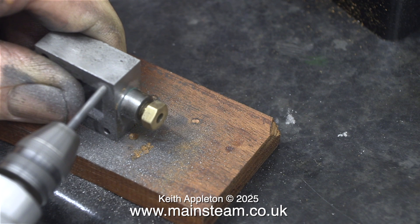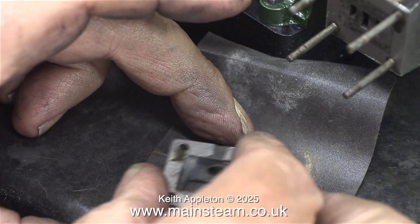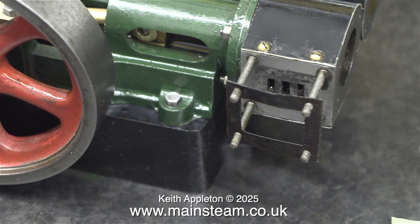This is the last hole to be drilled. Cast iron's really good stuff to drill, and as I wasn't enlarging the holes very much, all I got was some very fine iron filings. Before fitting the valve chest to the cylinder, I'm deburring it using a piece of wet-or-dry sandpaper. One of the gaskets for the steam chests, thankfully — owing to the cost of new ones — was okay, and this was slid onto the studs as shown here.